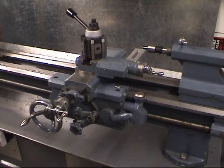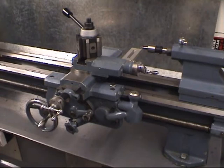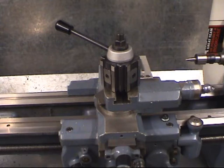We actually start screw cutting. I'll show you how I do it by reversing the lathe so I can't lose the thread. This is what they call single point screw cutting. A lot of people make the tool go parallel straight into the work. The correct way to do it is to tilt the top slide to half the angle of the thread. It's a 60 degree metric thread, so you set it across 29 degrees, just under half.